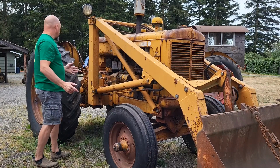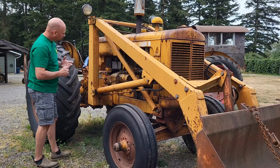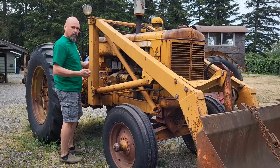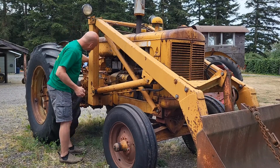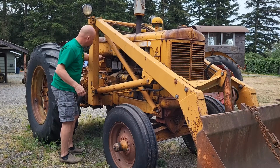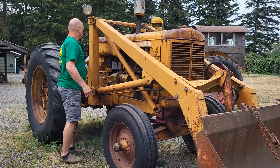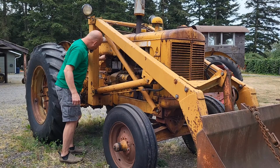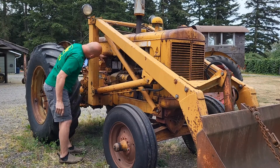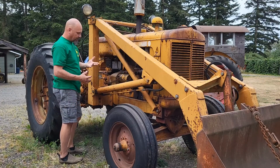Okay, we'll hook up the ground. This is a positive ground system, 6 volt positive ground. Although I don't know if you can see, I got an 8 volt battery in there, just a little more oomph. 403 cubic inches, you want a little more oomph, especially during the winter, right? All right, here we go. No spark. That's good. Maybe the water just crossed wires and is creating the short itself. Yeah, that looks clean enough. Just set on there. There's not much space between the battery and the tank, 5/8, 3/4 of an inch. So I definitely would have shorted my ring out again.